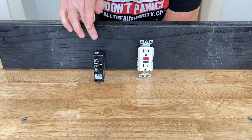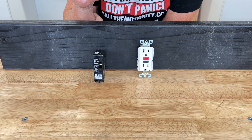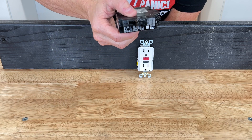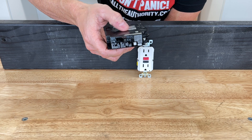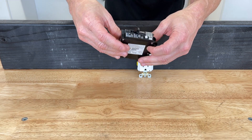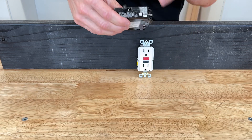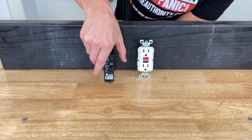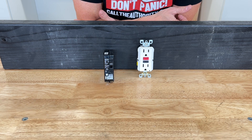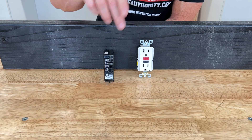On the right here is a GFCI circuit breaker, as opposed to a GFCI receptacle. You'll find these in the electrical panel — main panel or sub panel. When you see it, it's installed in between other breakers. It works like a regular circuit breaker: it's on, it gets tripped, it's off. To reset it, push the button to reset it and then turn it back on. Some homes have these, some do not — it was likely a decision made when the electrical was installed or during a remodel. I don't have a strong opinion on one being better than the other; your home may have one or the other, or both.